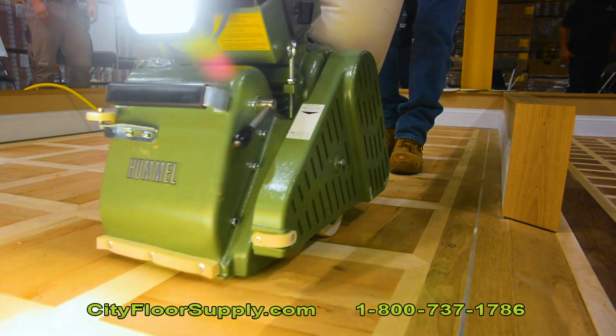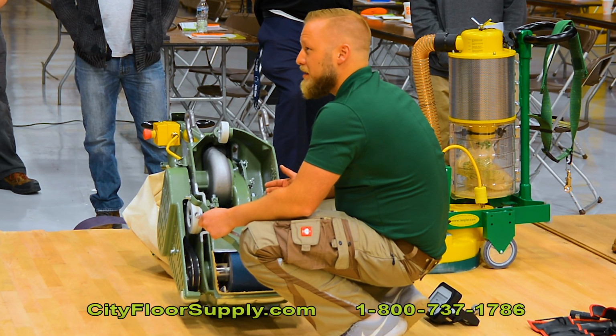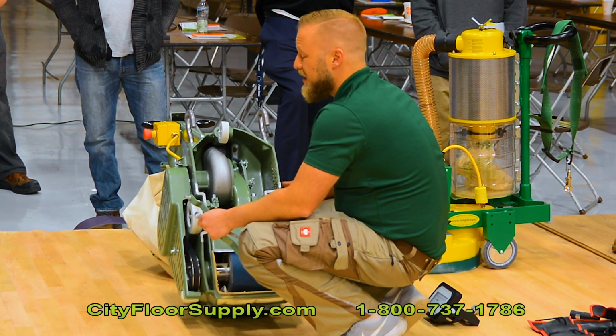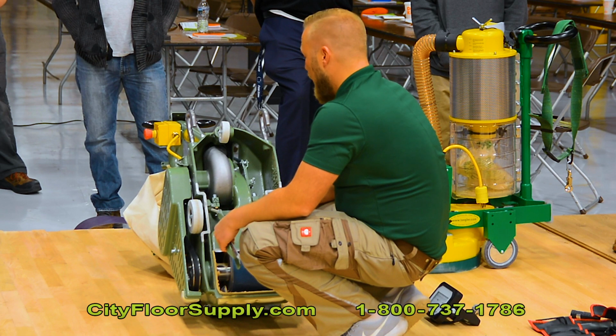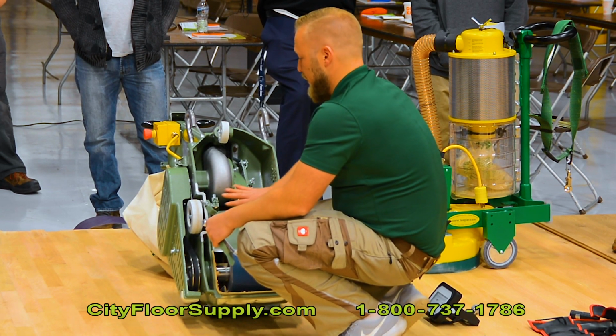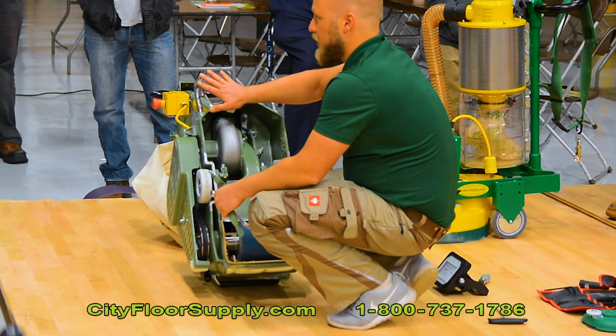As I said, make sure your wheels are always clean. If your wheels are dirty, I usually use a sanding screen or really fine abrasives. I don't like using scrapers because you can actually cut inside the wheels. Everything the wheels do, if there's an unevenness on the wheel, it will transfer to the drum. The same with the back wheel.